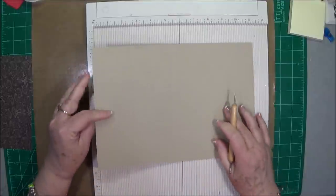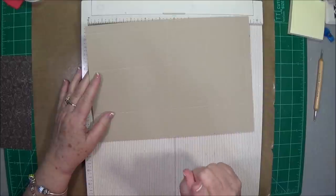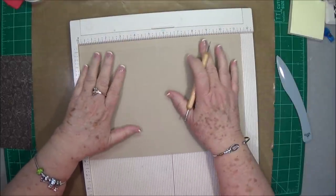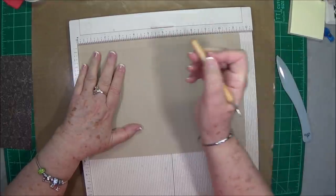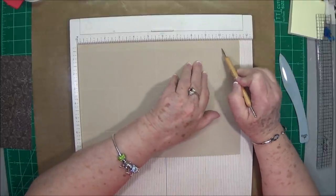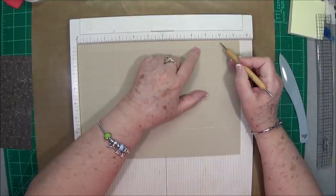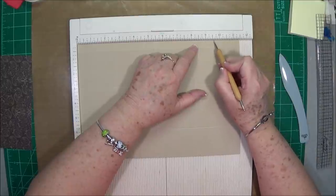All of these measurements will be on my blog — it may be tomorrow morning before they're up, but I will put them on there. Now turn it back around in your scoreboard to put your half inch side over here, just like you scored last. You're going to make a mark at four and one eighth, just a little indention there, and then go on down to the last block and make a mark in the center at nine and five eighths.